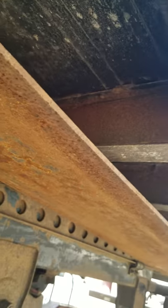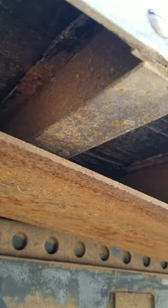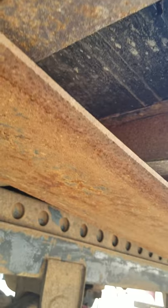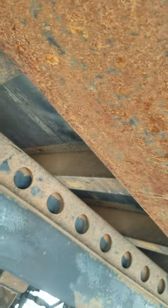It adds a little weight to the trailer but protects your cross members from recap tires. This is a very old trailer — we're not gonna put anything new on it — so this trailer is gonna get recap tires, and that's how you protect it from ripping out the cross members.